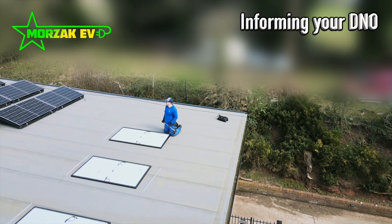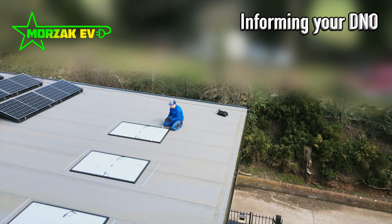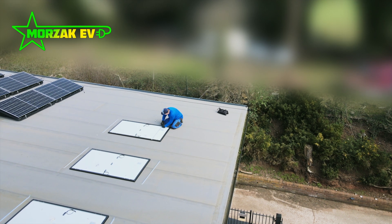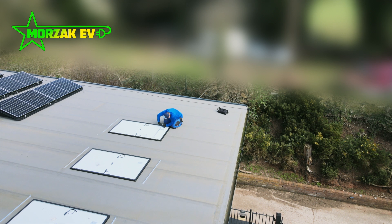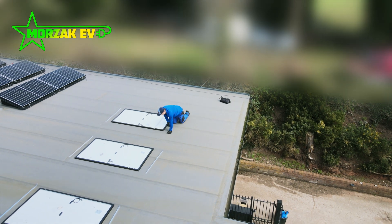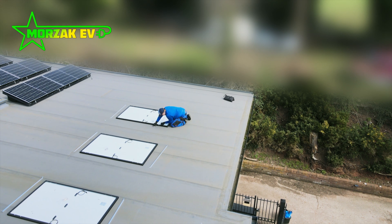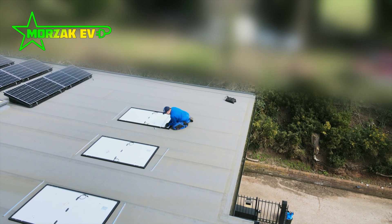For the solar panels, we've got 22 of the JEM60S10s. They're 345W solar panels, and that keeps us under the 8kW for the whole system. Incidentally, 8kW is what we applied for and got permission for from our DNO. Any system under 4.5kW doesn't need permission, but just needs to be notified to the DNO. Anything above this, you need to get permission.